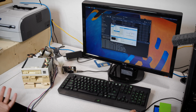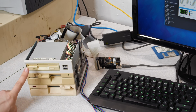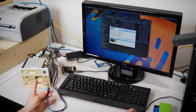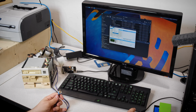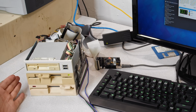So we're going to do drive 0 first, and we're going to calibrate here. So drive 0 here is the 3 1/2 inch drive. That's working correctly. So it sees 83 tracks at max because the head can go just slightly past, but that's normal, so that worked. We'll go to drive 1, and this is currently set so that it will access the 80 track 5 1/4 inch drive. So let's calibrate that. Light to light. And now that's moving.